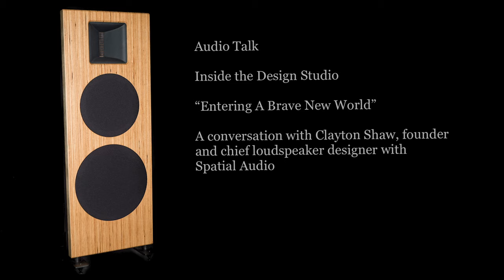All you have to do is go back and listen to a Klipschorn or Altec A7 — get back before the acoustic suspension days. They were all dynamic because speakers were developed initially for movie theater use when we converted from silent movies. They had to be extremely efficient and have controlled directivity patterns because the amplifiers were tiny two-watt amplifiers for use in an auditorium. The industry started out from a really good angle. Large companies like RCA and Western Electric were the ones developing this — highly scientific engineering companies compared to the tiny companies we have in our industry today.